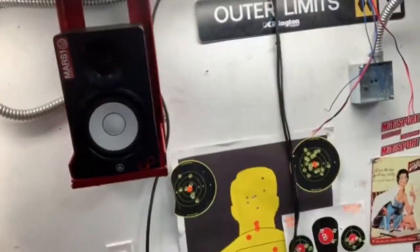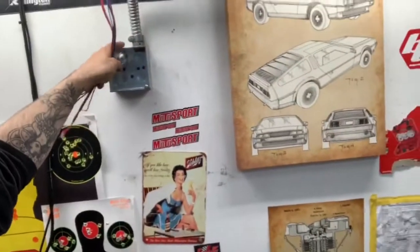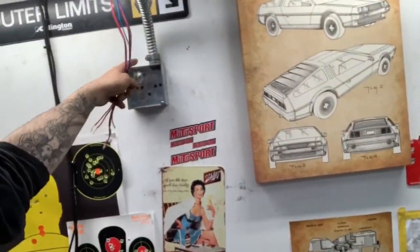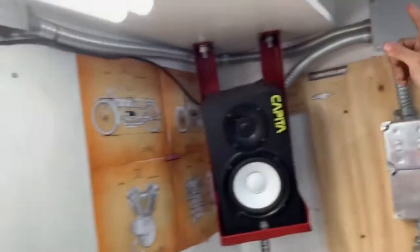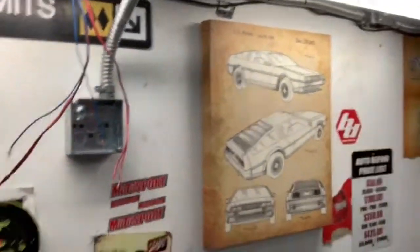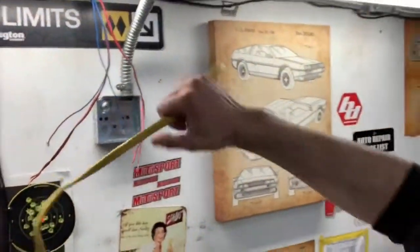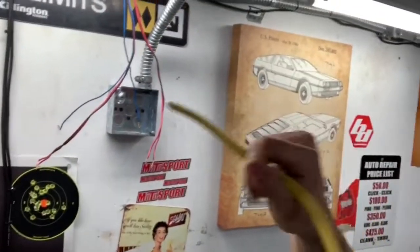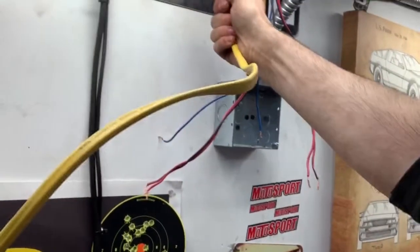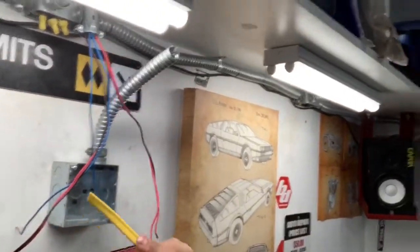Now that we have our BX with the cable inside going to the back of the speakers, and our two custom cables meeting in the middle with our J-Box mounted and the BX conduit ready, with the other BX wrapping into our main J-Box, we're now ready to tie this into our system. The way that we're going to do that is use a piece of Romex — I believe this is 12-3, meaning 12 gauge wire with three conductors. We're going to tie it into the light system at this J-Box and then run it through and tie it into a switch.